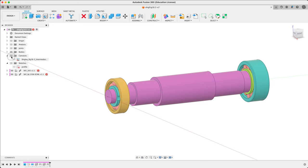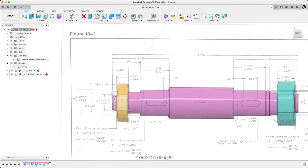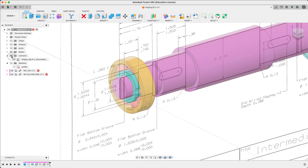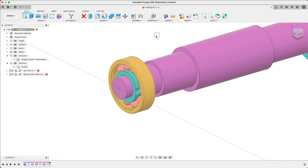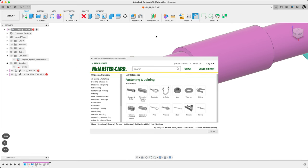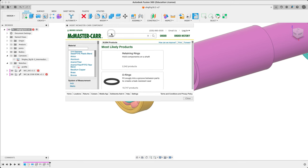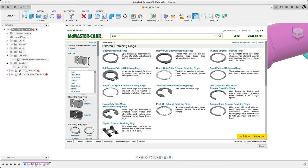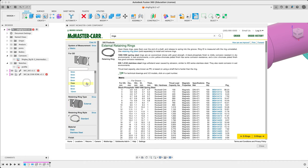Let's take a little look at the canvas. There's a ring groove here of a certain size. Because we changed the shaft diameter here slightly, we might find this is a little different and it might actually be in metric. So let's go ahead and do that. McMaster Carr — I have it right here, you can also do a search. I'm after a ring. The ring will tell us, as we've learned in the lecture videos, this is the ring groove. This is metric, and it's an external ring. We're going to go for standard.